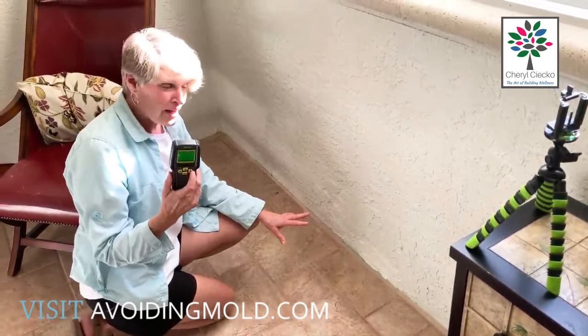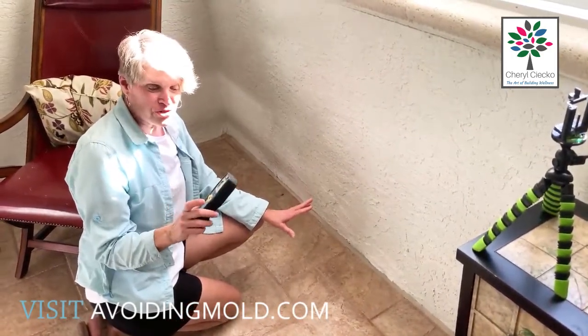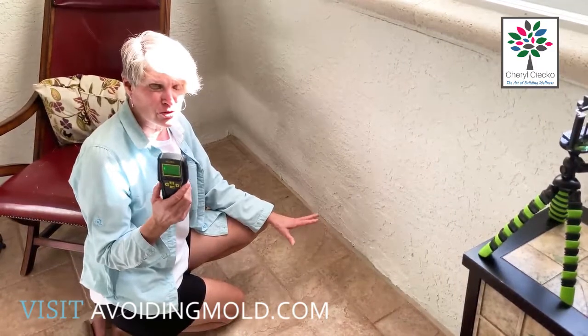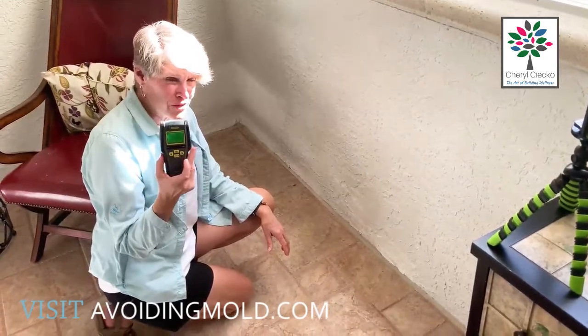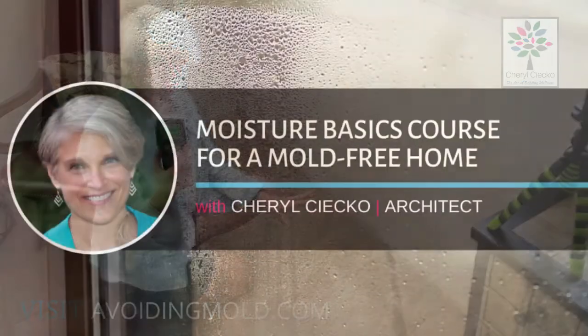So this is how to use this meter: use the right setting. Tile, I use masonry. There's hardwood floors here — I'm going to do that separately with the hardwood setting. If it's a wood structure, anything structural, you'd use the softwood setting. Drywall is a wall setting and that should be a very low number — single digits, definitely usually under five.